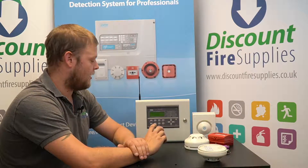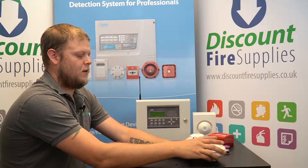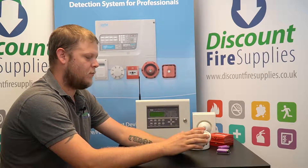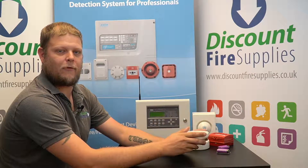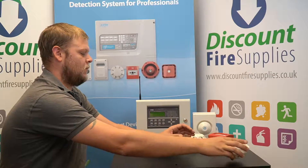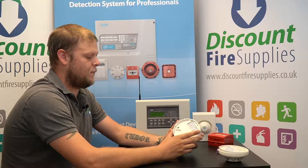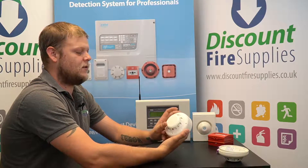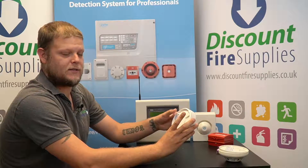The panel will reset once you tell it to, but the main thing to remember is that you need to reset the battery stats, because the panel is constantly monitoring and needs to know the batteries have been replaced to get accurate readings again. To do the battery stat reset, take the device in your hand and press the front button and the rear tamper button together.